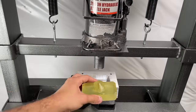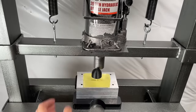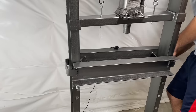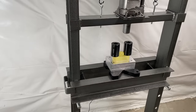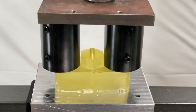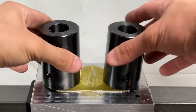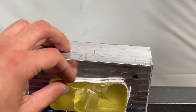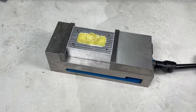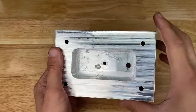For the second cavity, we didn't want to press directly on the tip of the mold, so we grabbed shaft couplers to use as a spacer and moved the press bed down. We restacked all the components and started to press — but right away we heard cracking and noticed a break at the base. We forced it all the way in anyway, and it turned out the entire top of our mold broke. We need to redesign the mold to be a little smaller. To remove it, we loaded the package in a vise and hammered and drilled away at it, getting the part out but damaging the cavity bottom slightly.